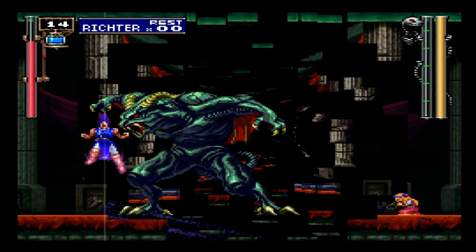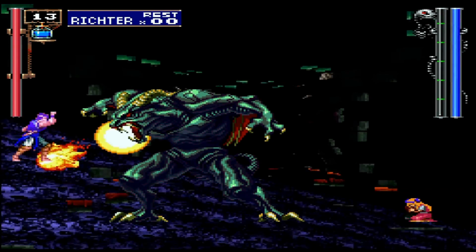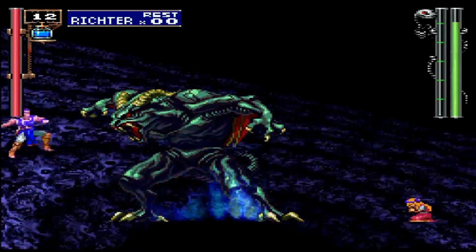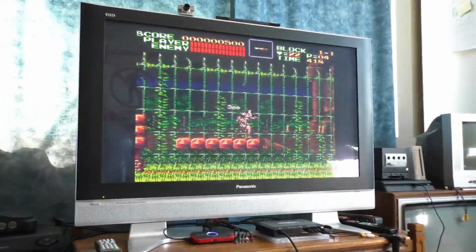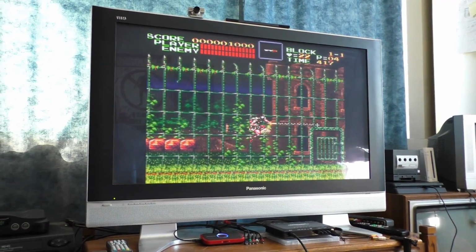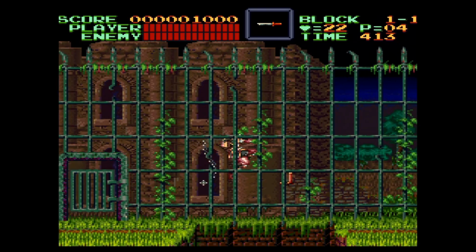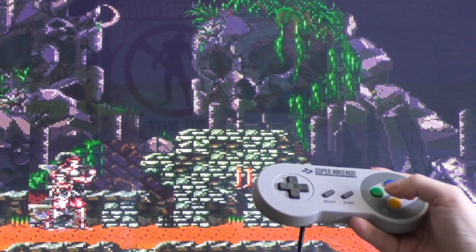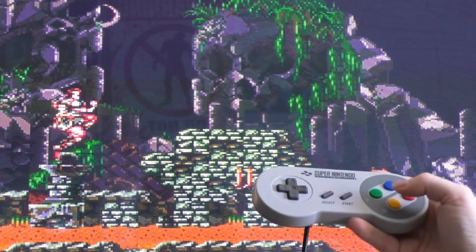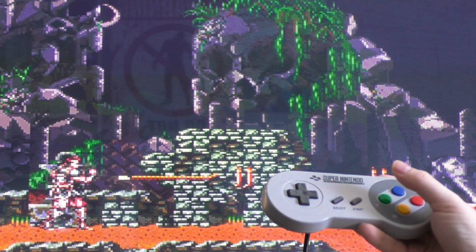The device does a great job at upscaling the traditional 240p resolutions of old systems into 720 and 1080p resolutions for modern displays. My TV is actually a Panasonic from 2006, so unfortunately it can only support up to 720p, meaning all the Framemeister footage you'll be seeing from me is recorded at 720p, 50 frames per second. The plus side of the older TV is that it doesn't have any of the features newer units have that contribute to input lag.